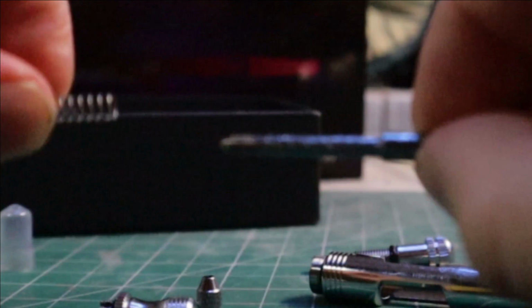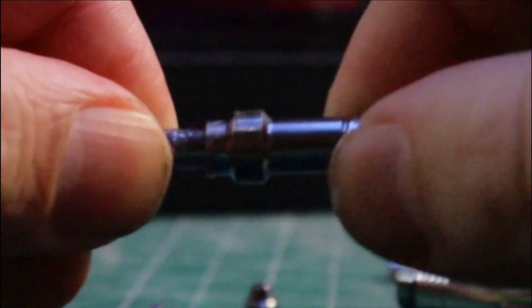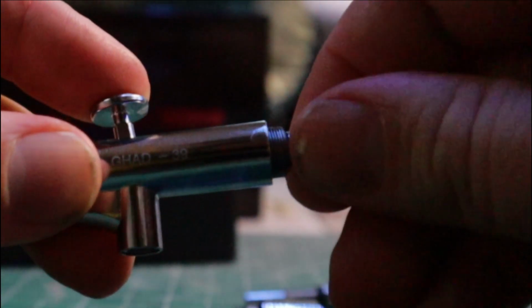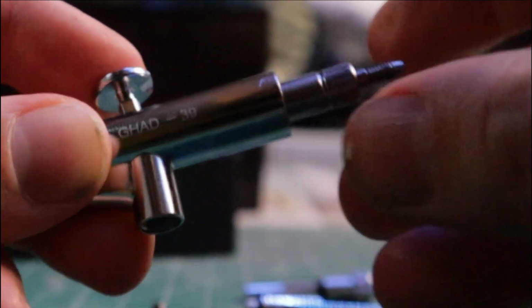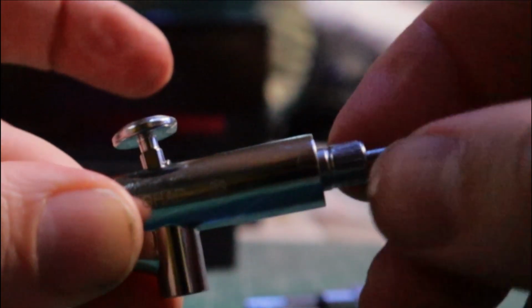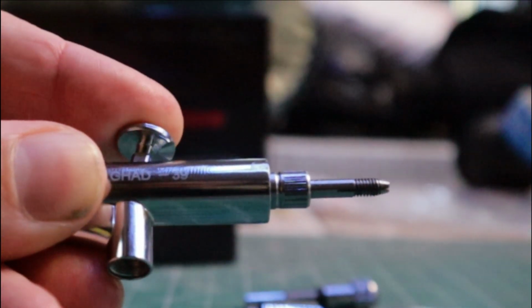The spring goes over the needle guide thread end, the sleeve goes over the needle guide. Pinching the thread of the needle guide, you push it all the way until it pushes up against the tongue and screw in, pushing the whole assembly back. By exercising it, the needle guide should pop in and out. Be careful as it can all undo until the needle goes in.